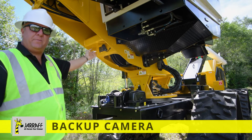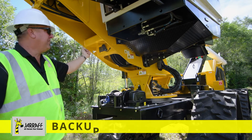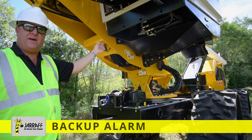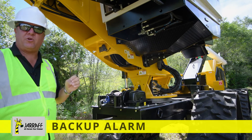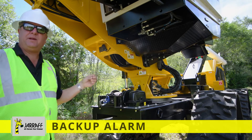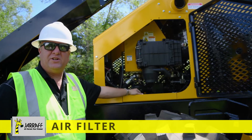Here at the back of the giraffe we've got a couple of safety features. We've got our backup camera — when you hit the pedal backwards or the joystick, you're able to see what's behind you on the monitor inside the cab. We've also got the backup alarm — it'll start with a beep-beep noise to warn anybody nearby that the machine is backing up. In the winter time, the backup alarm will also beep when you first start it up, indicating cold hydraulic oil. Once the hydraulic oil reaches temperature, the alarm will stop beeping and you're ready to operate.